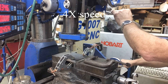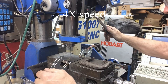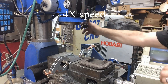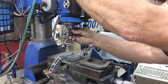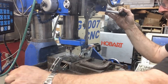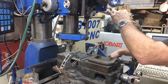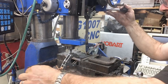I'm just drilling the holes here to bolt the bed assembly to the base. These plates get welded to the base; we're match drilling them in the mill. It could just as easily be done in a drill press — a benchtop drill press — it doesn't make any difference what you've got as long as your holes are where they're supposed to be. This is a mill we converted to CNC a few years ago, and I still use it in manual mode a lot because stuff like this is easier to just drill manually. We've got a digital readout on it so it's really easy to set everything up and drill them and countersink them.